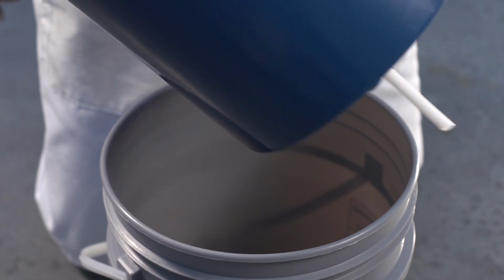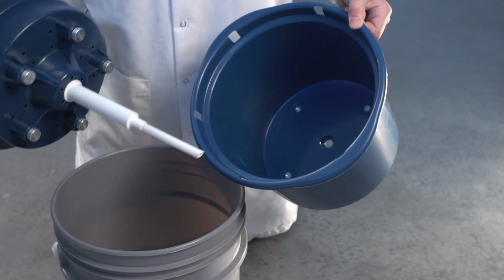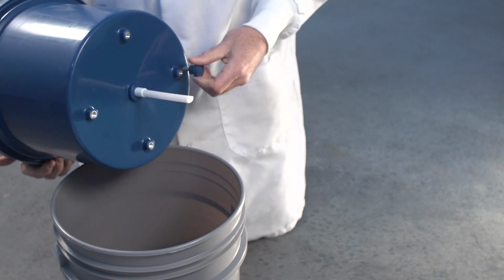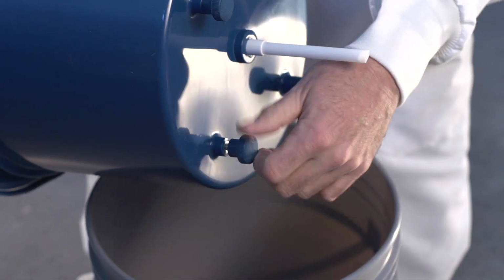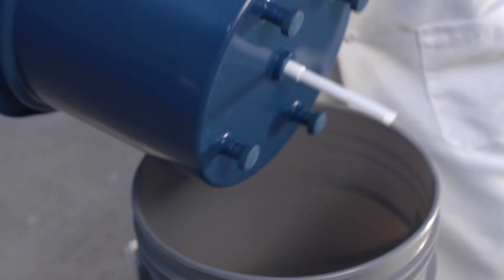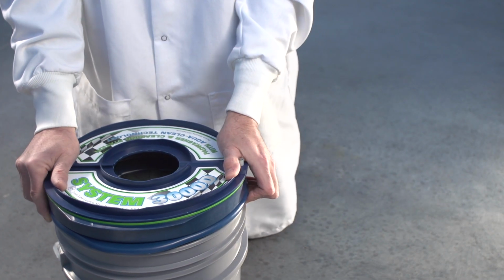When operating in captured mode, the catch basin retains the dirty solution without the use of the filter. Close the drains to the catch basin by inserting plugs on basin bottom. Clean pads and then discard the dirty solution when pail is emptied.